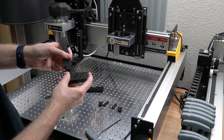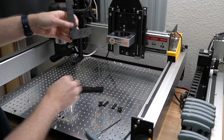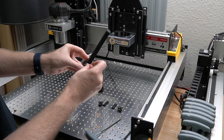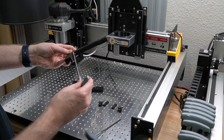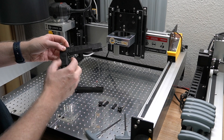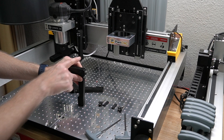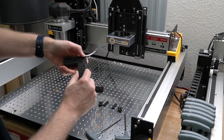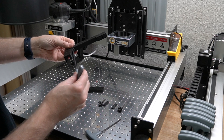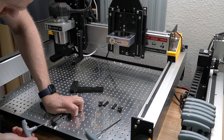Let's repeat that for the other side. Drop the screw in, grab the M5 nut, push that in and hold it there as we tighten it down. There shouldn't be any gap, and if you see one, just press it in. You can set this on a flat surface and gently tap it — even with a light rubber mallet, not very hard at all. Be careful, you don't want this cracking on you. Put it down on the flat surface and tighten to final torque.